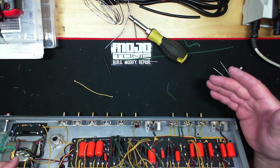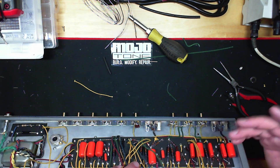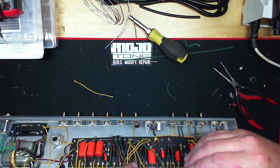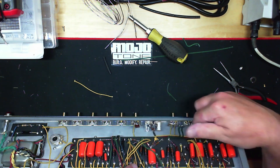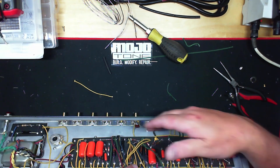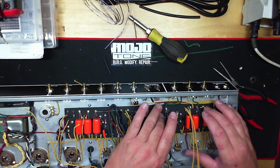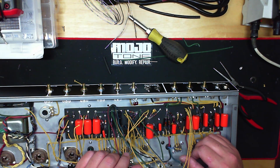Because you had to use a big 100-watt iron on the production line and scrape off some of the galvanization to get a good solid joint, they used those brass grounding plates when installing the pots so you could do that very easily. The bus bar across the back was used in other electronics too — hi-fi amps, TV sets, Heath Kit ham radios, shortwave radios. It does take a while to wire in: you've got to measure, straighten, bend, and solder. That's why Fender went to the shield plate — it speeded things up. Nowadays you can still get them on eBay, but they are kind of expensive and totally not necessary.